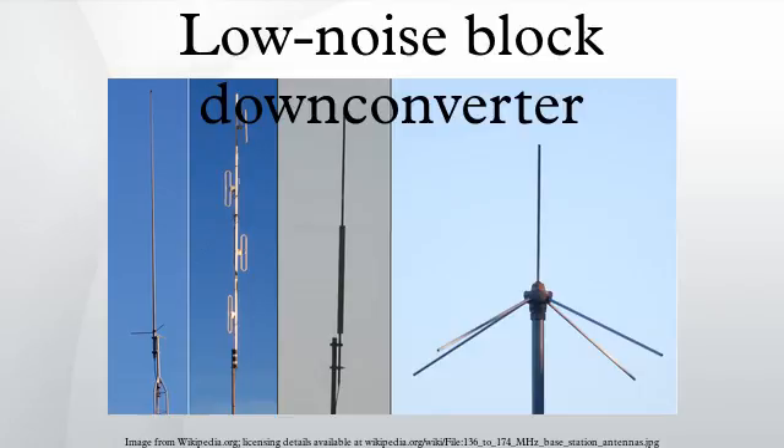In a C-band antenna setup, the transmission frequencies are typically 3.7–4.2 GHz. By using a local oscillator frequency of 5.150 GHz, the IF will be 950–1450 MHz, which is again in the receiver's IF tuning range. For the reception of wideband satellite television carriers, typically 27 MHz wide, the accuracy of the frequency of the LNB local oscillator need only be in the order of plus or minus 500 kHz, so low-cost dielectric oscillators may be used.